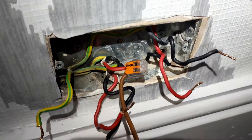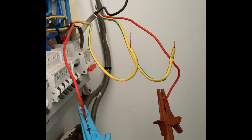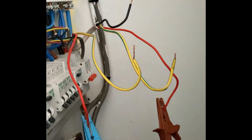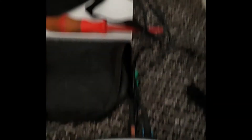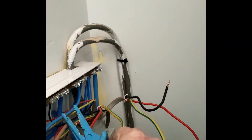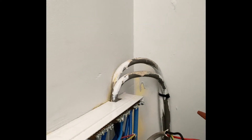As you remember, we had nothing on the line and nothing on the CPCs at this installation. What I'm going to show you now is that we have something on the line. The line leads have been nulled and that's the reading we're now getting on the line: 0.4. Moving the cables over, we should get the same reading — 0.4 — and yes, near enough, 0.39.